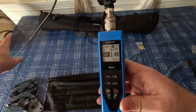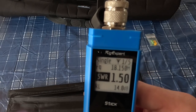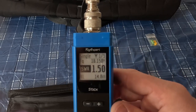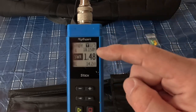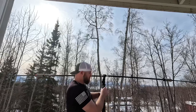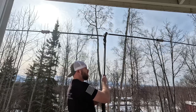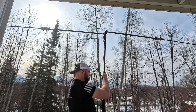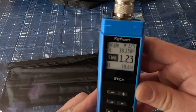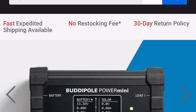So we got the antenna tuned up. Currently on the Rig Expert stick we're at a 1.49 to 1.48 SWR, but we're still very low to the ground. I like to shoot for a 1.5 initially, and then as you raise the antenna the SWR will start to drop. We'll raise it up a little bit — we can't go too high because it hits my hex beam. We just raised it one extension on the mast and as you can see we're already at a 1.24 to 1.23.